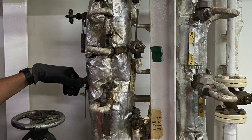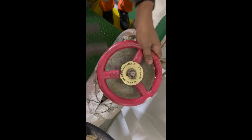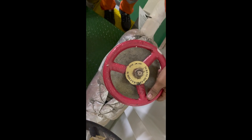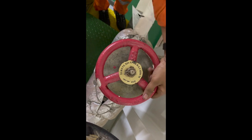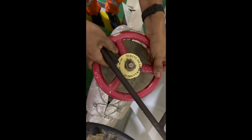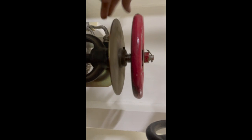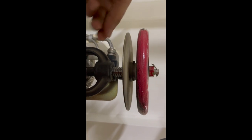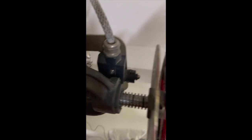Our boilers are running on LSMGO so we do not need additional tracing steam for LSMGO. This is the main valve taking diesel oil from the MGO service tank, going to the fuel oil supply pumps, circulating pumps, and to the system. I am opening the MGO service tank outlet valve, which goes into the three-way valve and then MGO goes into the system. This limit switch plate gives an LED signal showing that MGO is in use.